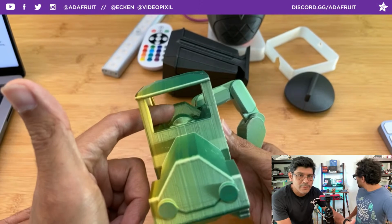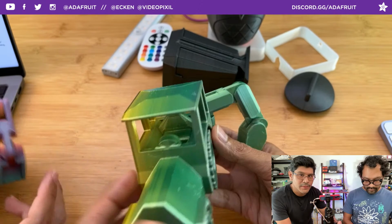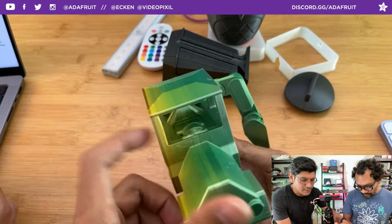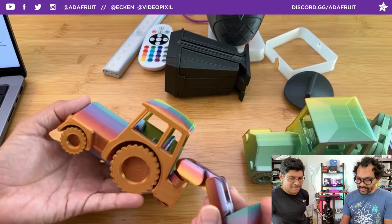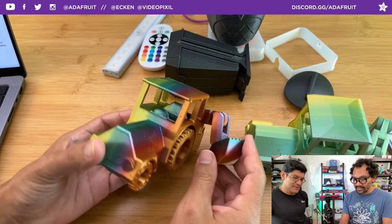Clever. So with the chair, they've added a drafted angle there to avoid an overhang. A lot of the internal here is all drafted edges. Man, drafted edges are the best. That's bomb diggity. Oh, you printed it twice. Yeah, another reason to print one of these is to look at how it was actually designed, how they did all the angles and the drafts and where to put them. I wish we did that more. Super inspiring on how to design something without any supports.